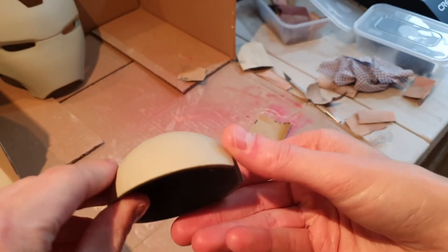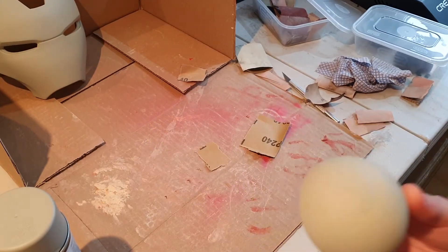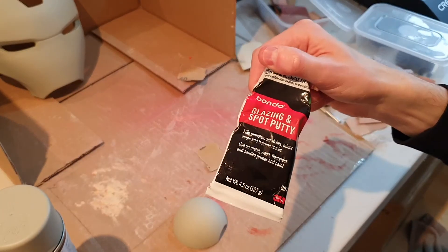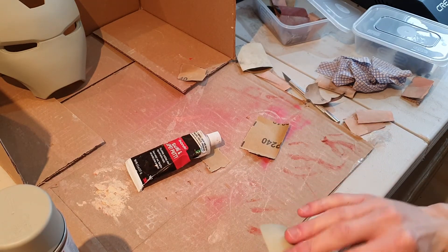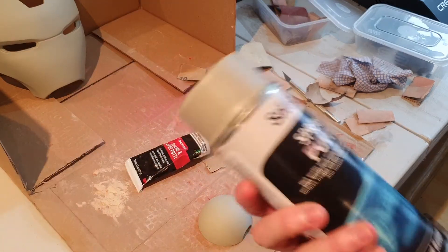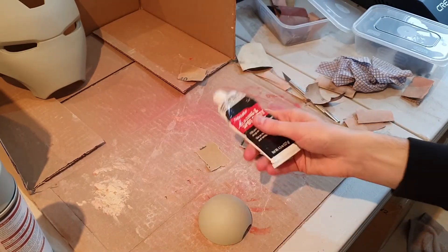After those light coats you can see it's smoothed out quite a lot, but when it does focus I've still got some pretty deep layer lines. I could carry on spraying but I want to be quicker, so what I'm going to do is take some of this Bondo and smear it on the deepest grooves. Then I'll sand it back down until it's all gone and all I should be left with is filled layer lines - that makes it a lot quicker and saves wasting a lot of putty. Please wear a mask when you do that.